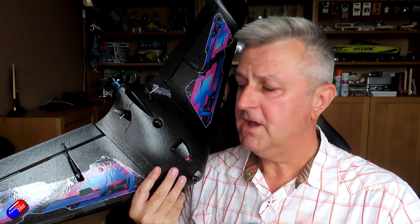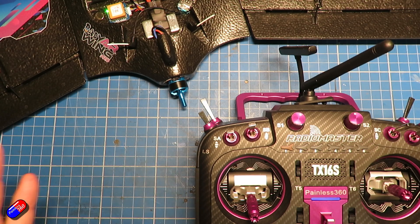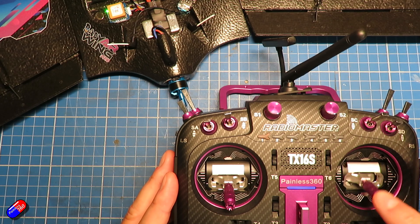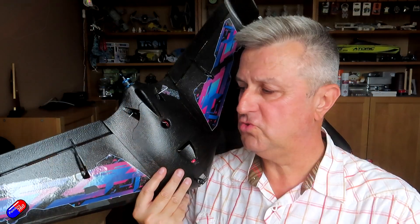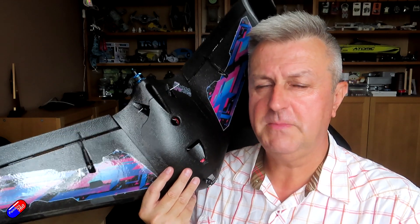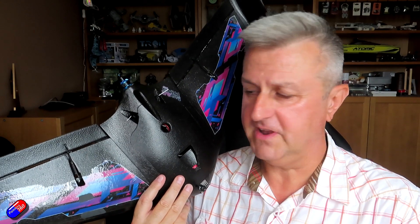And finally, you need to do the test on the bench — not only when you're setting it up, to make sure that the control surfaces work in manual mode when you're moving them, but also that INAV corrects them in the right direction too. I would recommend doing that test every single time before you chuck the model, just to make sure that nothing has gone wrong and it's going to fly beautifully.